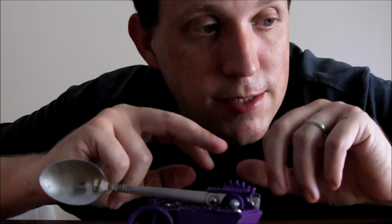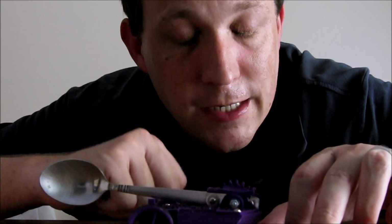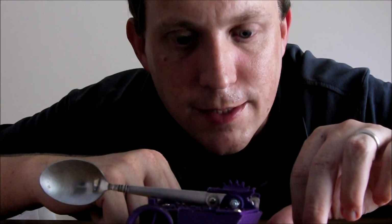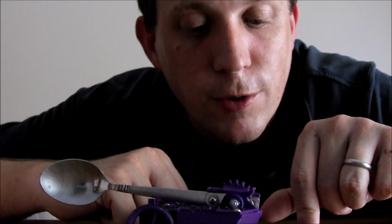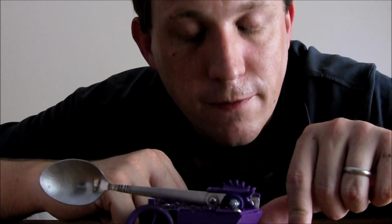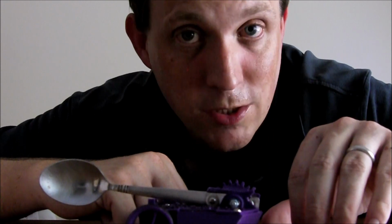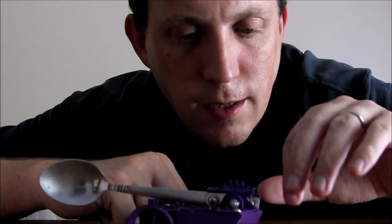Before I started working on Huntsman, I realised that wedges on the front of axe robots is actually a bad idea, and I'm probably the only person who thinks that. And I can prove it though. If you watch the videos of the latest season of BattleBots with Beta vs Nightmare and Beta vs Tombstone, both of those spinners ride right up the wedge of Beta and hit the weapon mechanism and disable it.